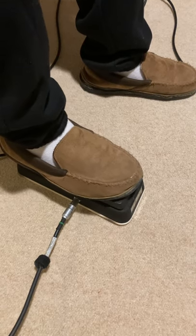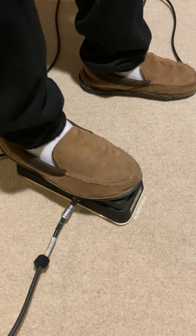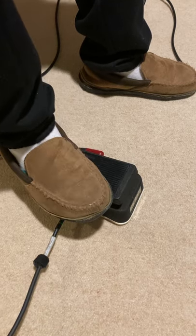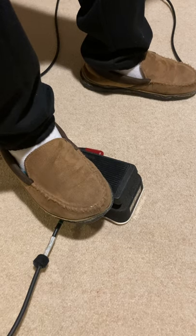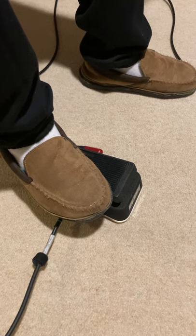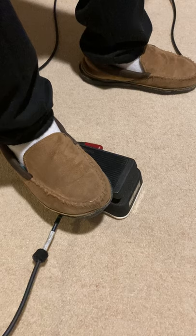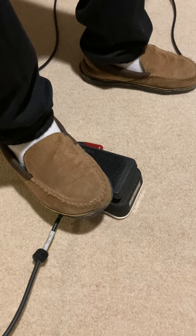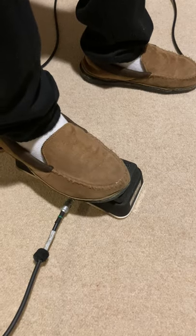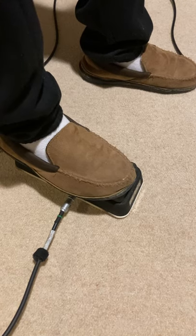It's kind of working, but it's definitely more than just a scratchy pot — it probably needs a new part. There was also an earthing issue causing humming with the new power cable, so I redid the joints for the earth on the power and also the input and output jacks. You'll probably notice it's not buzzing and crackling as much anymore.